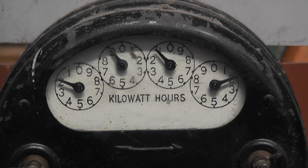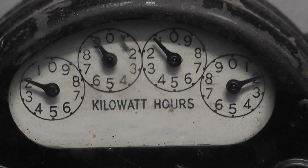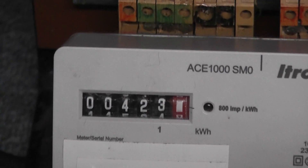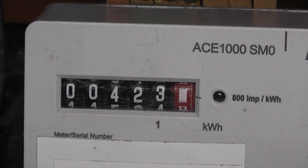Well, this is a day later — today the 4th of July. The i14 has recorded 30 units while the check meter has recorded 29 units at the moment, which means the meter is running a little bit fast — about 3%. Not too much to worry about considering it's quite an old meter.